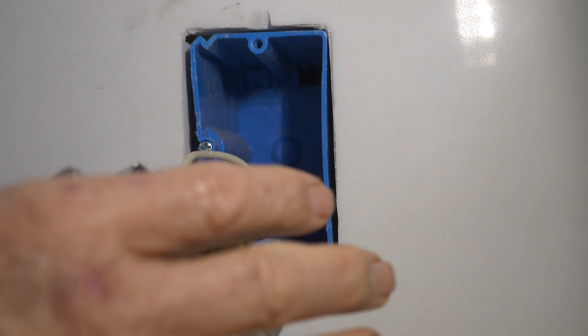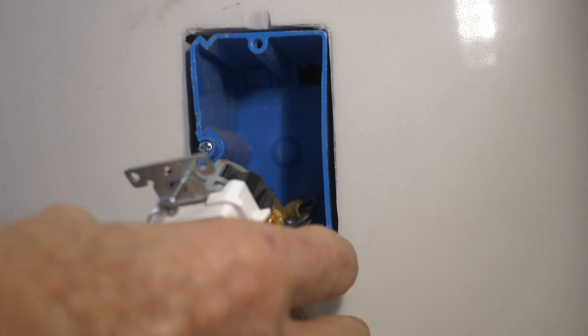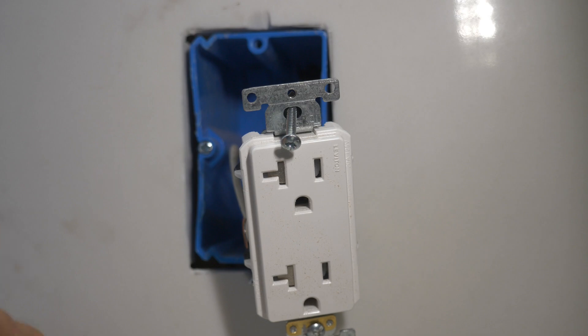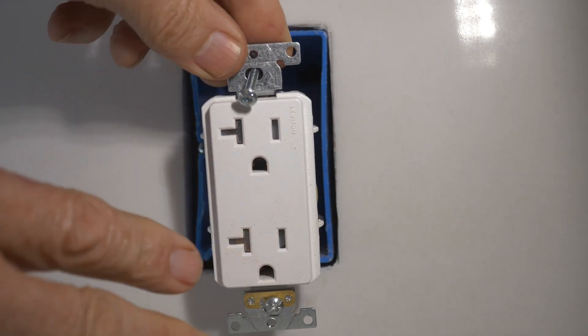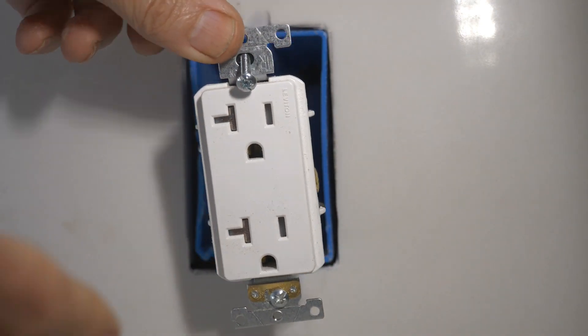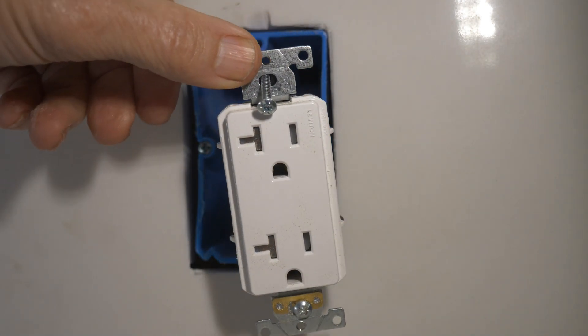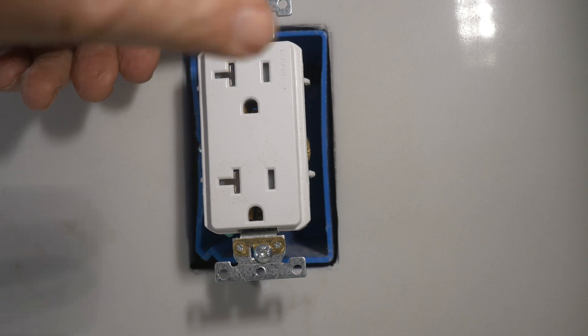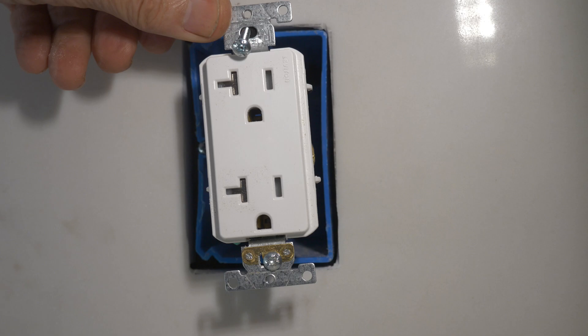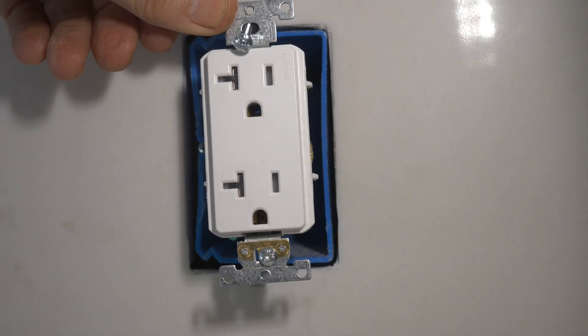See, it's end-of-the-run. And if there's ever anything wrong with an end-of-the-run receptacle, you check to see if anything's wrong with the receptacle itself. Look at the terminal connections, make sure everything's tight, and test it out. If it isn't the end-of-the-run receptacle, the problem is at an upstream receptacle.